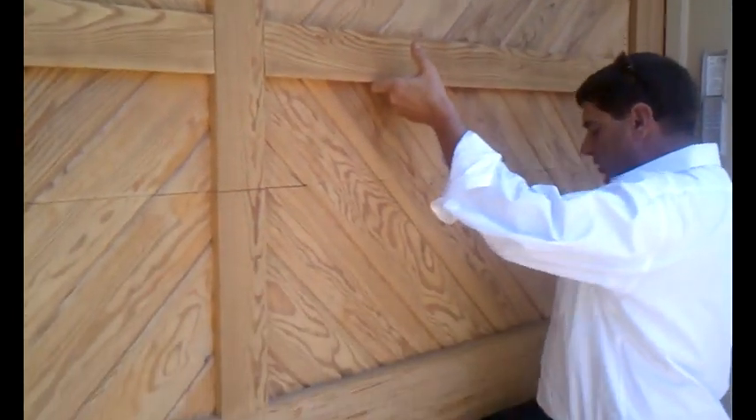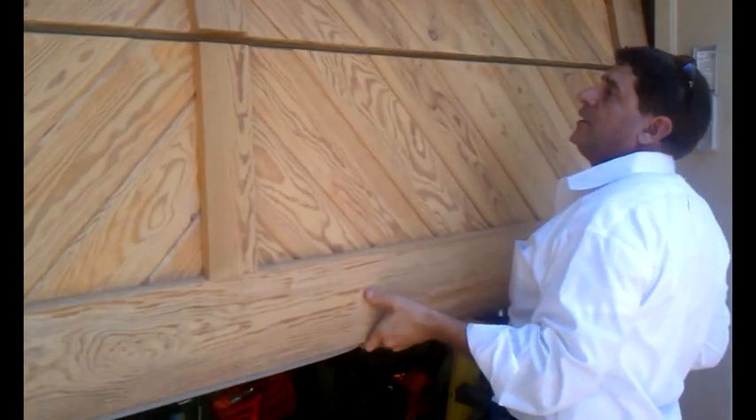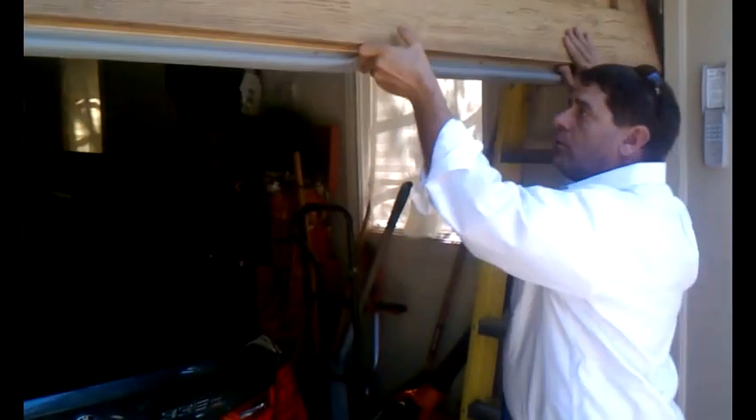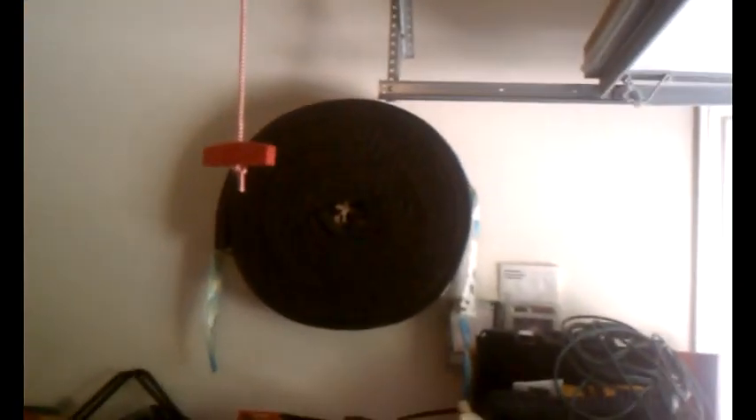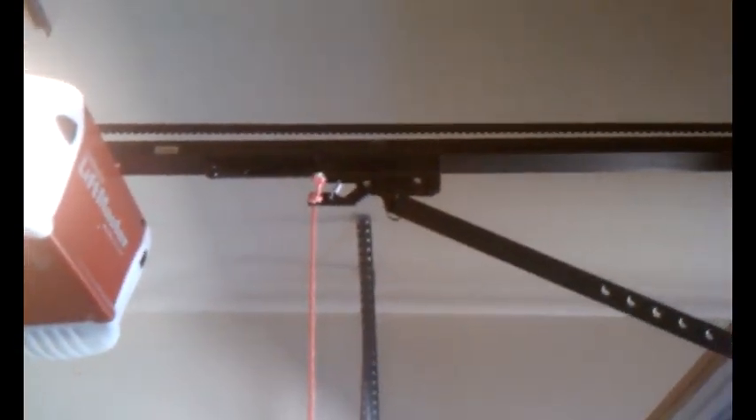In order to control the doors manually and work with them easier, you can see that handle inside on the red pulley with the rope - just pull that down and it will disconnect the garage door from the assembly, allowing you to work it manually. When it is time to re-engage the garage door, merely push the door open button again, the motor will cycle through, and it will pick up the garage door and it's back on track.